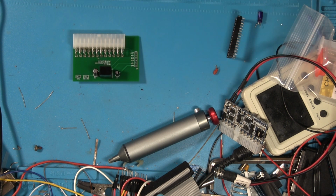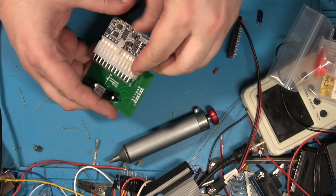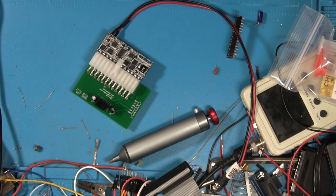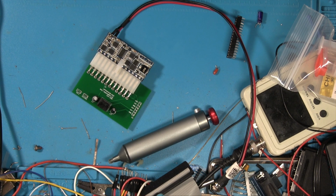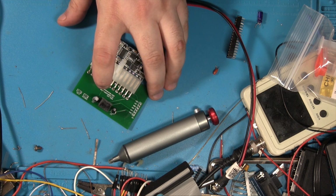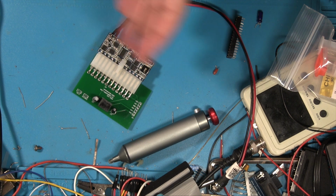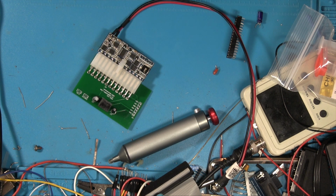It's fine. Right, so the next step is we need to connect our Pico ATX goes in, that's the first good sign. And we need to actually stick 12 volts in this thing. 12 volts center positive, obviously. Now you probably see also we haven't put a switch in. So the idea is we just need to bridge that. So I will turn it on first, make sure nothing weird happens there, and then we'll try bridging that and then seeing if the voltages change.